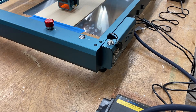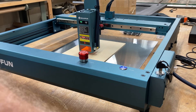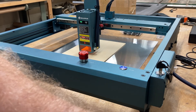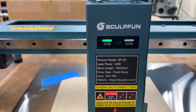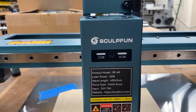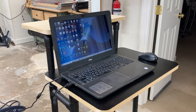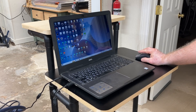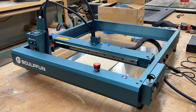The time has come to turn on the machine. Turn the key into the on position and right next to that you have the off and on button — press that and the light comes on. The laser is activated and I have it set for the 20 watt setting. You can also hear the air pump in the background — all of that starts with a push of that button. The green light above the 20 watt setting indicates we're operating on the 20 watt side; flip that switch and we switch to the 40 watt side. I also plugged in the USB cable into my computer and I'm going to open up the Lightburn software. As Lightburn turned on with the machine on, it had the automatic home feature activated, so it went to the XY zero home position.